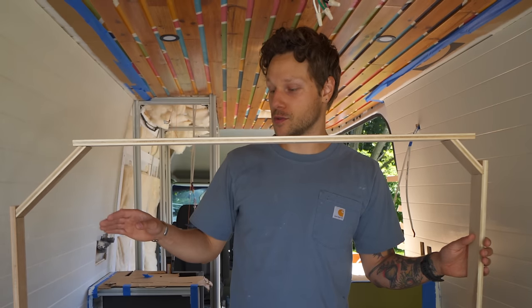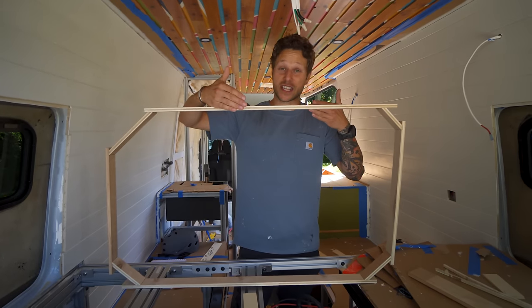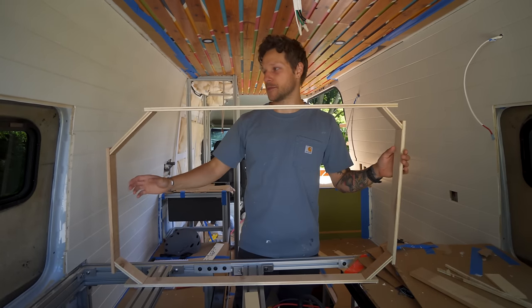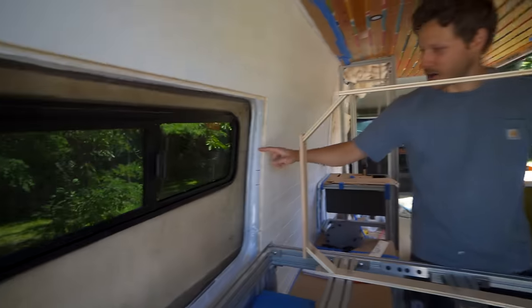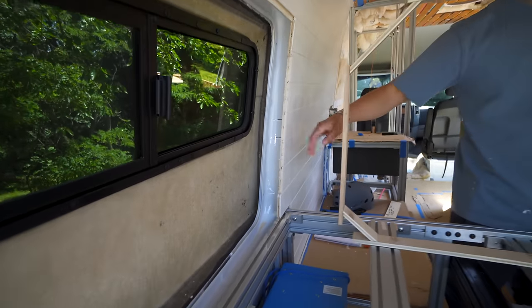We are going to make this thicker. We're going to start at 5.5 inches thick, and then we're going to scribe it down because when we took a measurement, all of these spots reaching up to the wall are about 5 inches.